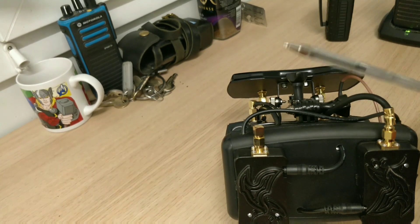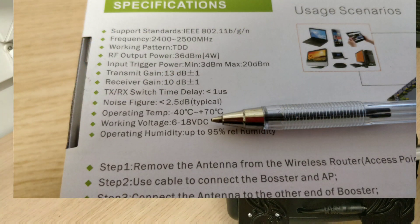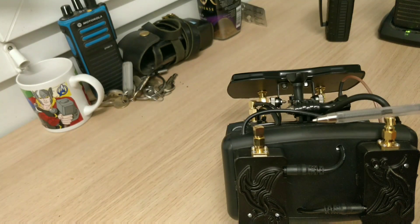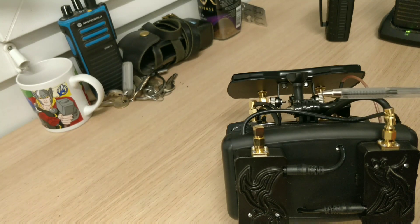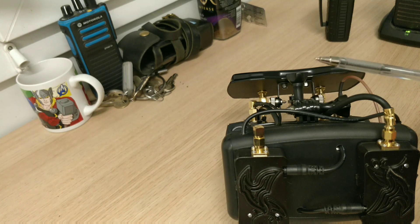Inside here is a power pack — this is what powers these. They are rated from 6 to 18 volts operating power. They've only got a 2.5 dB noise figure, which is pretty low, and they say they've got 13 dB transmit gain and 10 dB receive gain. They also run in the spectrum of 2.4 to 2.5 GHz.